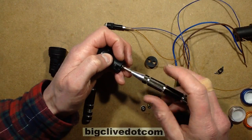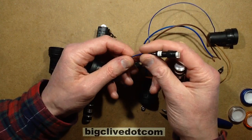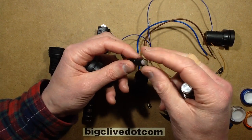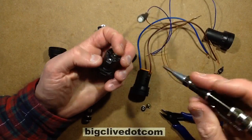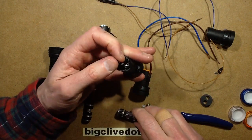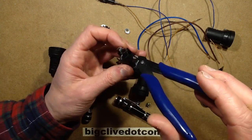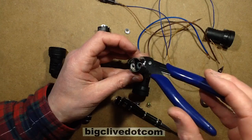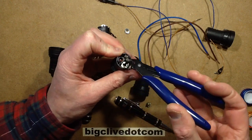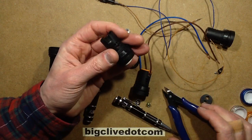I'm not keen on tiny little indicators like this operating at 380 volts because the connections inside are just going to be so... I've had so many instances in the past that you've gone out to work on a panel and you found the problem with the panel is the control circuit was dead because one of the indicator lamps had exploded. And the reason was that they were using these tiny little miniature Edison screw type lamps, but at ridiculously high voltages, like 415 volts or something like that.